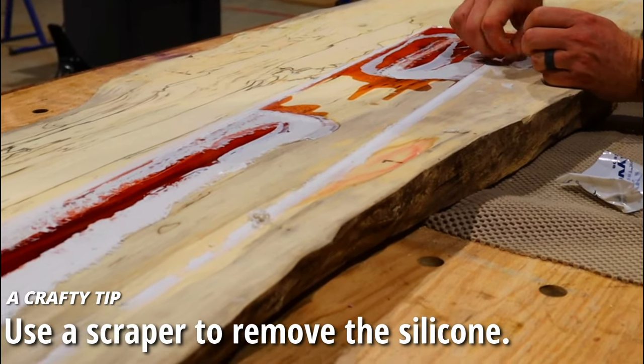And now the moment we've all been waiting for — the flood coat. Three ounces per square foot of crystal elegance. We pour it down the center of the slab, mixed the same as every other coat by volume not weight. We tip the bucket over to get everything out and let it lay on the slab. Then using an eighth-inch trowel, we trowel it starting from the center moving to the outsides across the entire top surface. Resin will actually self-level, but we still use a trowel.